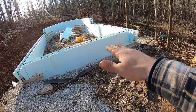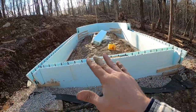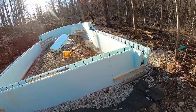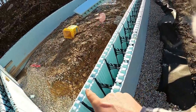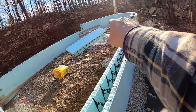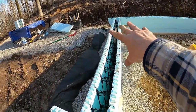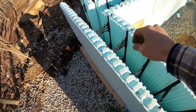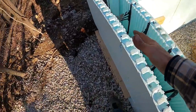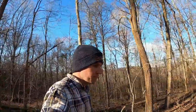Now, there may still be some water on the footer, given small variances in the footer. There may be a couple places that kind of puddle up, but that's no big deal either. Whenever we pour, we'll start the hose over here. We'll chase that water all the way around, and it can push out anywhere along the way, obviously out into the foundation drain. But if there is any still in the walls, it pushes around. When it meets our first lift, it gets forced right underneath and out the foundation drain. No problem at all. Great question, though. Excellent question.